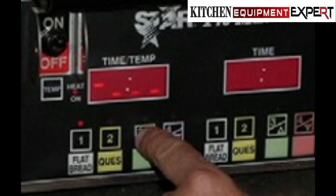5. The preset temperature will now be displayed. 6. Set the desired temperature for this program using the plus or minus buttons. 7. Press the temp button to save the temperature and to exit programming mode for this program. The LED will stop flashing but will remain lit.